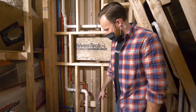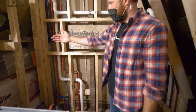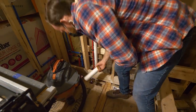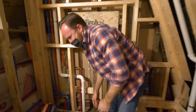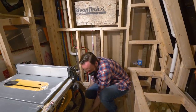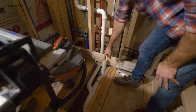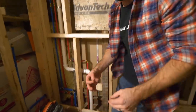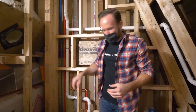Looking down at the floor, we talk about our curbless and linear drain detail a lot — how we like to have the back wall, left wall, and right wall all come down and land right in line with the drain so there are no weird reveals. It's critical that this drain location is perfect. The subfloor is left loose so we can tie into the drain. Left and right needs to be dead center for our Schlüter drain, and then the distance from framing to center of drain has to be carefully mapped out.